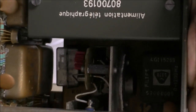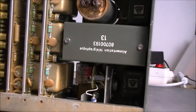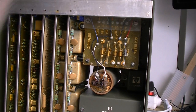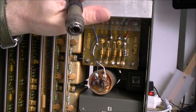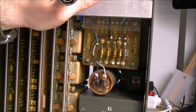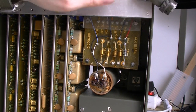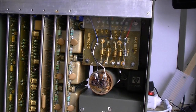There are two - or maybe even three - reasons I cannot try to connect this thing to the mains. The first is the general condition of rustiness; I do not know if there is not a short to earth or something like this. The second reason is this plug, which is quite specific and I do not have a pinout. I could find the pinout from the wires at the back, but I think it would be quite a bad idea to connect it to the mains.